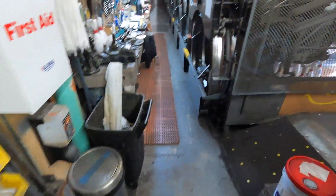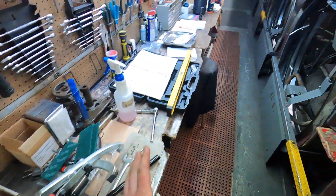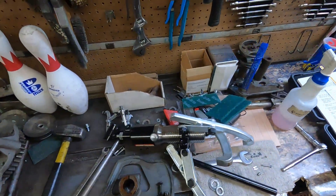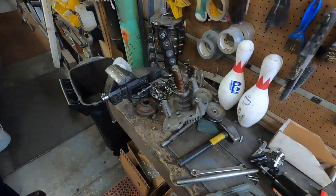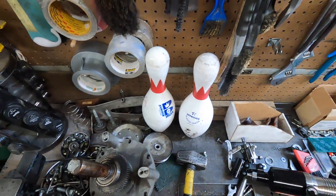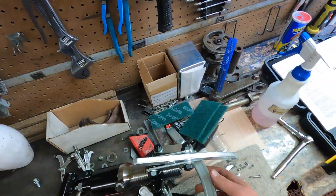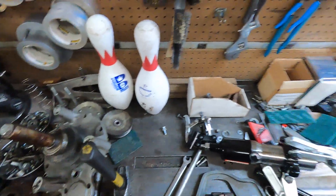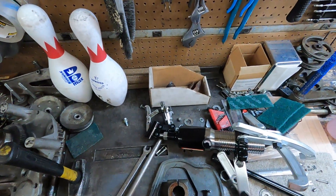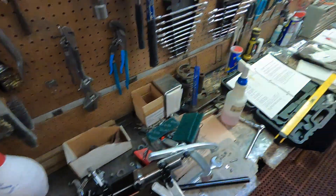So the first video back — we're going to do something fun. This happened over the weekend: the moving deck cam follower shaft bolt. I was tightening those and then a couple frames later it snapped and broke the plate that holds everything together. So we're going to have to change it out on machine 22.